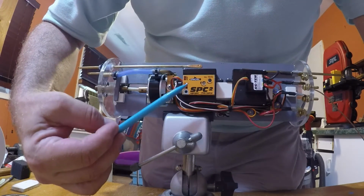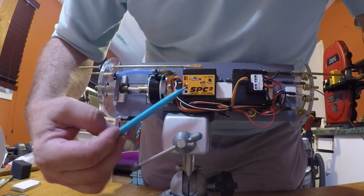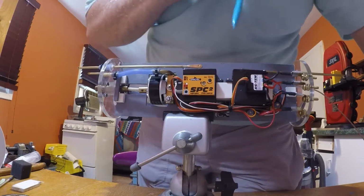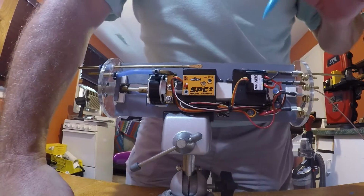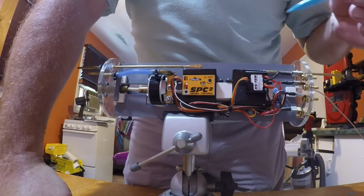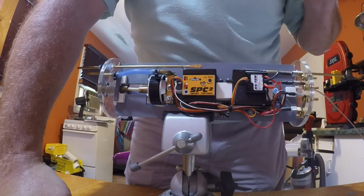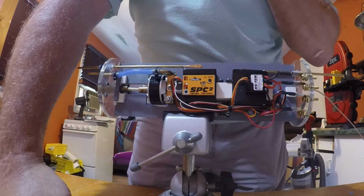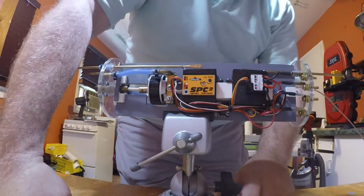Here's an Engel SPC2 APC, automatic pitch control. Here's the RS10, which activates the electronic ballast control. Basically, it's a modified mic. Subworks modifies them so they only have full forward, full reverse, so I can operate a paddle style ballast pump, because this is using the skip style ballast system that was originally available in his Albacore models.